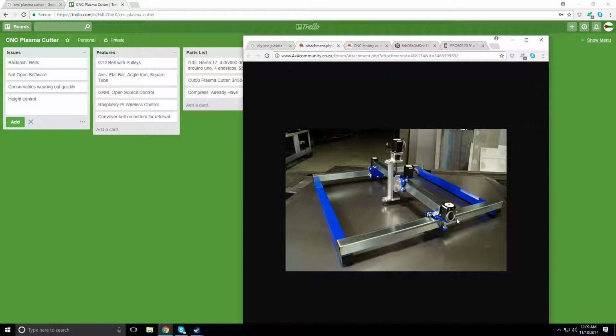Sure, it's going to knock some of the repeatability off, but that's fine by 1,000, 2,000. I'd just rather not have any sort of vibrations oscillate through this beam across. But you see how easy it is to have this, where it's just box tubing, box tubing, box tubing, box tubing. So for this guy, I'm thinking do the 3-inch plate, and then have the V bearings right on the side of the 3-inch plate.